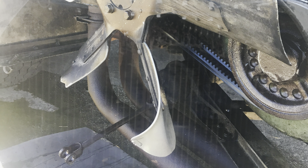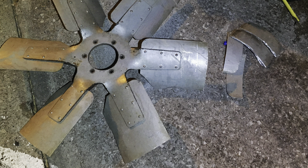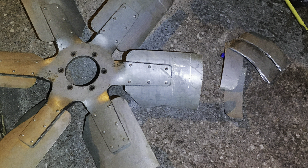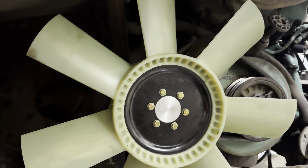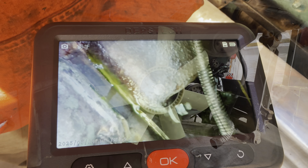A few years ago, I had my fan come off and go into my old radiator and that messed it all up. I had a replacement fan from an 8V71 — I just cut it shorter. I used a Sawzall to cut the ends of the larger fan off so it would fit in there, and used that for years. Now I was able to find a new plastic fan. This is a left-hand rotation fan, so it's a little harder to find. Ordered a new one, put it on, got it back together, pulled it out of the shop.